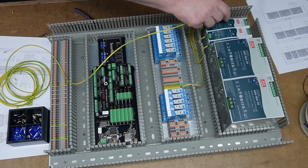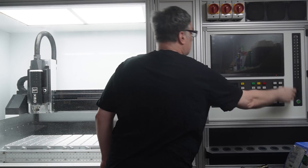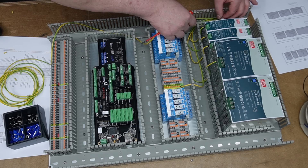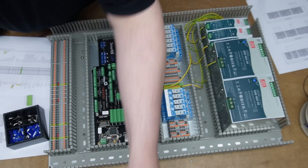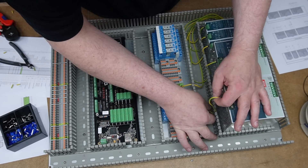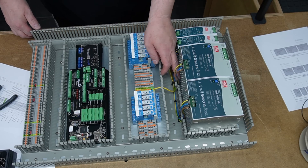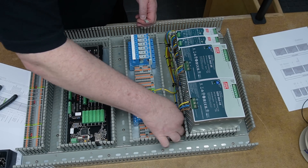I started the wiring with the 230V power lines. I have the main switches outside of the controller in the enclosure. From there, the 230V lines go to a distribution block and from there to the individual PSUs. Ideally, you add a circuit breaker for each PSU matching its amperage draw. I skipped them, however, mainly because of the available space in the cabinet and the already built-in protection features in the Meanwell PSUs. In addition, the 230V line is dedicated to the controller and is protected by an RCCB. But when you use PSUs without protection features or just a toroidal transformer, an additional circuit breaker is highly recommended.